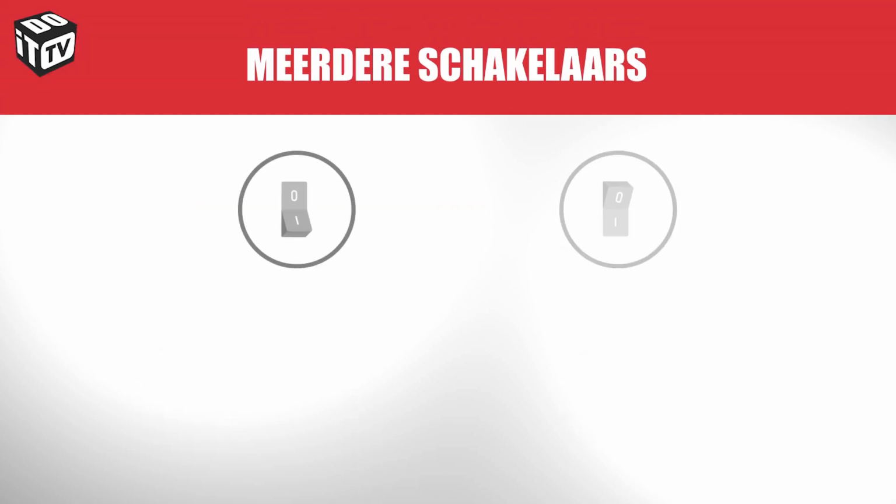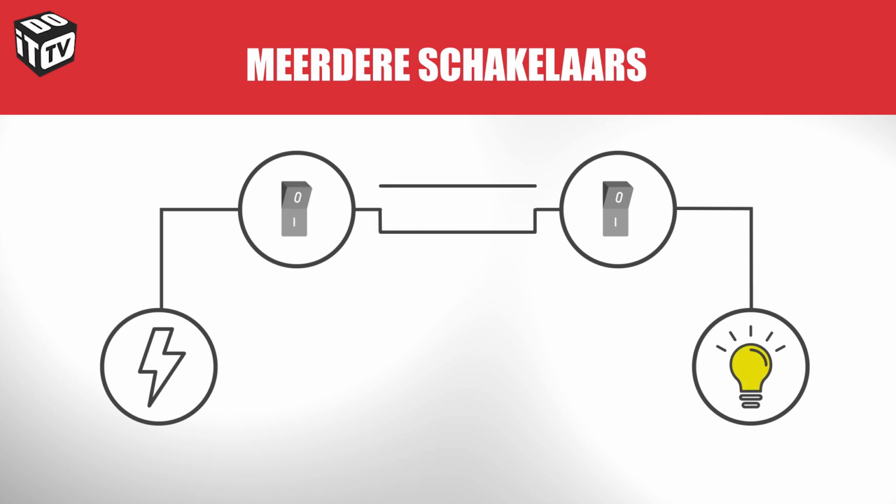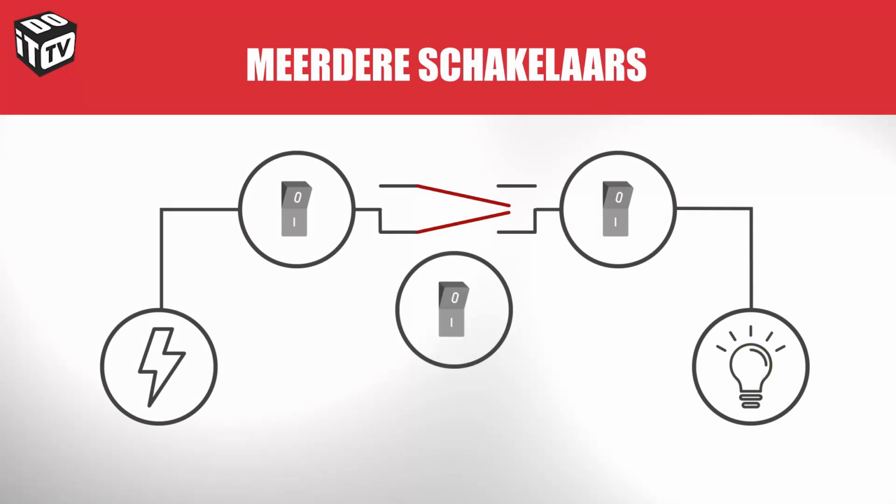If you have 2 switches controlling the same lamp, these are changeover switches. They have a phase wire and 2 changeover wires. If you have 3 or more switches, there will also be cross switches between the toggle switches. They have 2 incoming switch wires and 2 outgoing switch wires which are essential for the system.